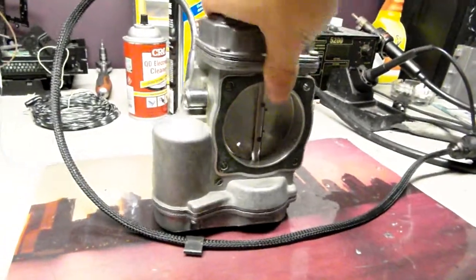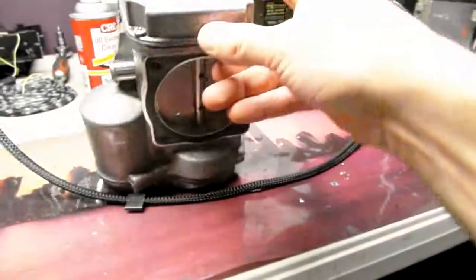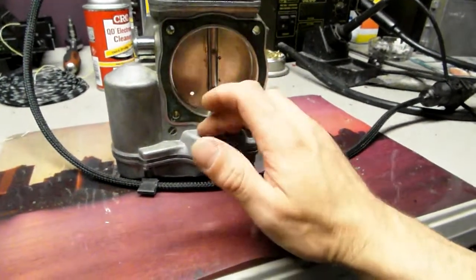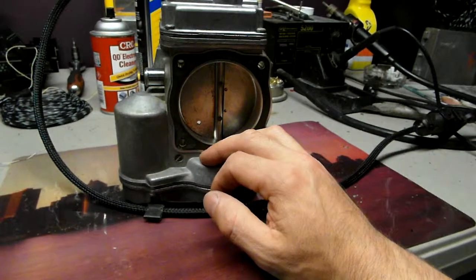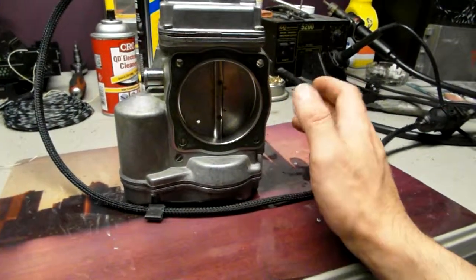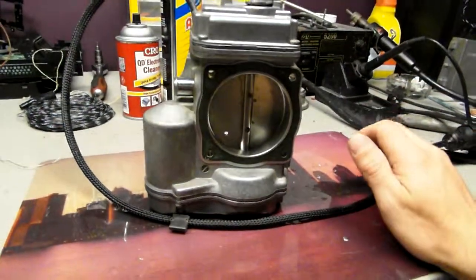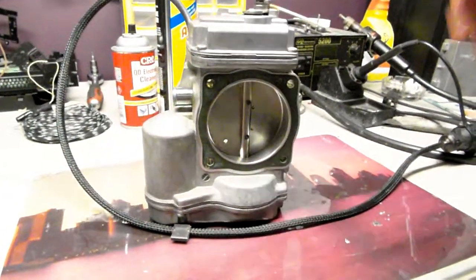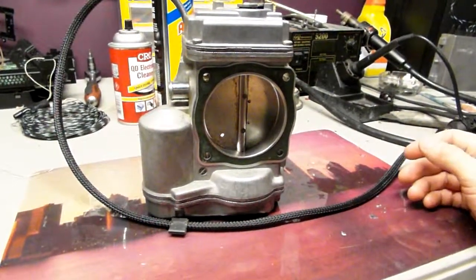Now the next step is to leave it energized with my e-gas module on the bench, because when it gets hot, we're going to check for the clutch coil. 99.9% it's going to work. It rarely failed on me. It's only 1 or 2 cases where I came back to inspect it after being energized overnight, like 12 hours, 10 hours, 8 hours, and the unit did not work. It's only 1 or 2 units. Usually the clutch coil fails completely and does not work at all. And this thing started to work right away, so I don't see a problem with it.